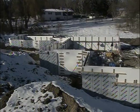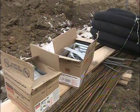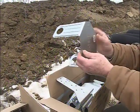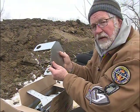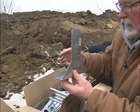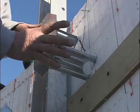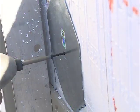Now it's time for the pour. There are a couple of connectors designed specifically for attaching your ledger board around the top of the wall. One actually goes into the ICF form itself — it sits flat on the outside. When the concrete is poured, it goes right into these holes and does a beautiful job of anchoring it right to the ICF. When it's time to put the ledger board on, the ledger board fits right into this slot and screws to the face — it really does a nice job of holding it. For now, we just need to have the connectors in place along the top of the form before we hang the floor truss.